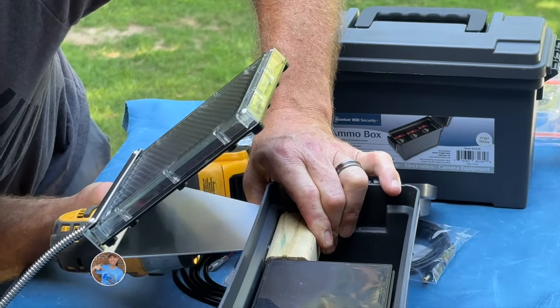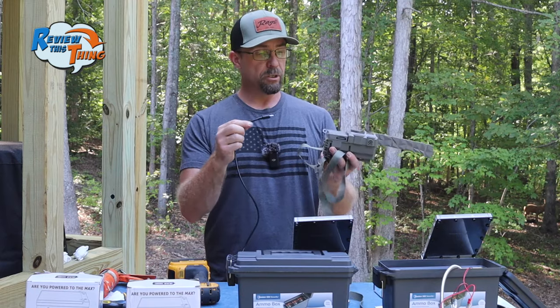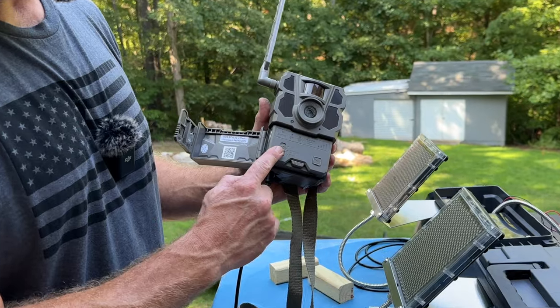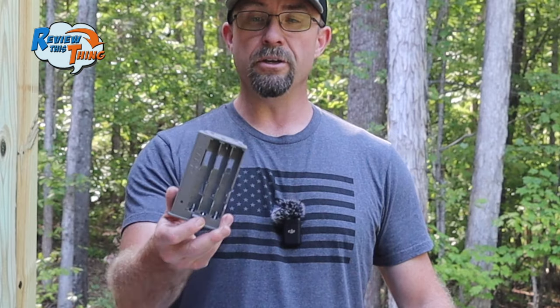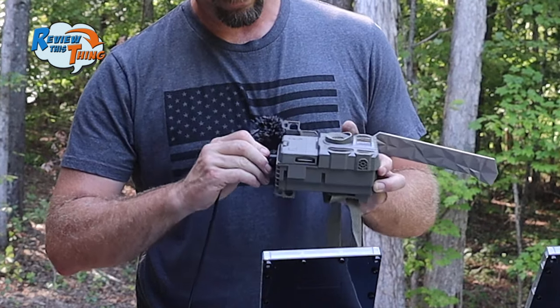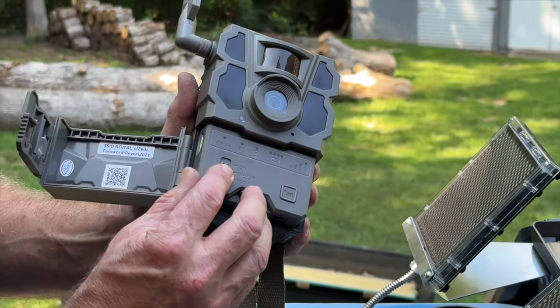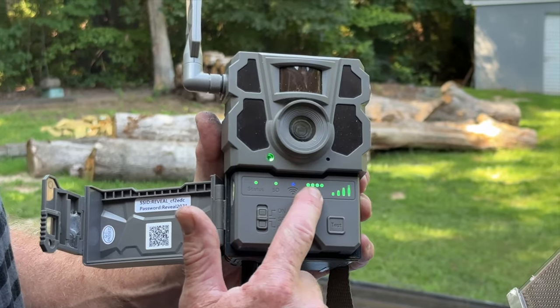Get the panels mounted to the outside and we'll be done. I'm going to go grab a trail camera and we're going to plug into it and see if the trail camera will come on. There are different cords that plug into the 12-volt system here, so make sure you get the cord that fits your camera. This is a Tacticam Reveal X 2.0. To test and see if this actually works, we're going to use the regular AA housing with no batteries installed. It has an external port that this cord will plug right into. If this system is actually going to work, we should be able to turn the camera on and you'll see these lights come on — and yes, you can see the battery indicator has four lights right there.